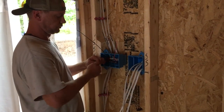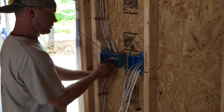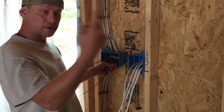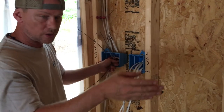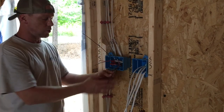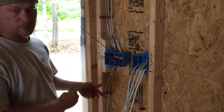Then you've got to screw it on. Holding this back, we're going to use each one of these three wires for a switch. My travelers will get a pigtail for a hot. I'm feeding it over here and switching it over there — that's terminology meaning the switch is being fed here, and the switch leg is the common on the other side. I identify it by wrapping around like that so I know this coil is my common. I also strip the end of that one so it's identifiable when I go to put my device on the switch.